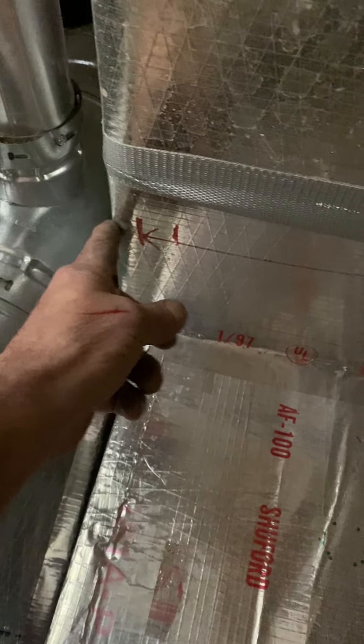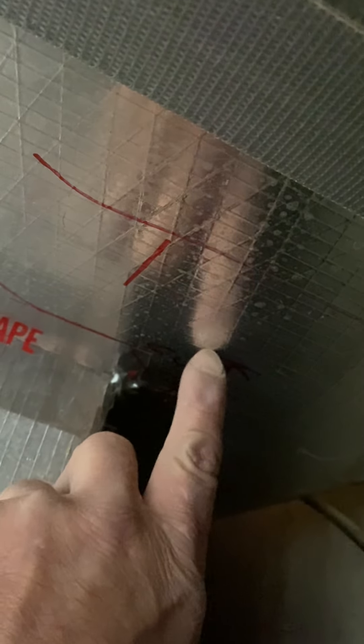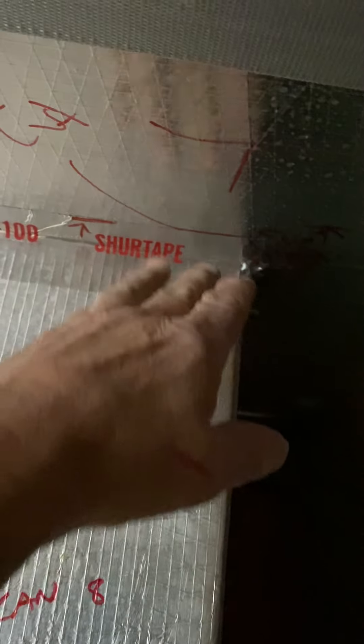The existing is just duct board. I'll give you a cut line one inch in on each side, and then in the back you'll sit back.